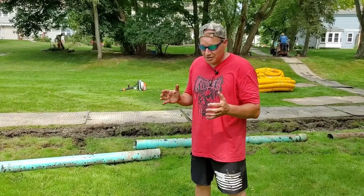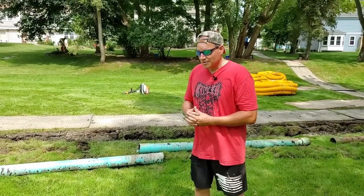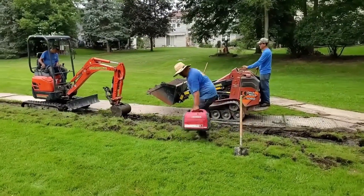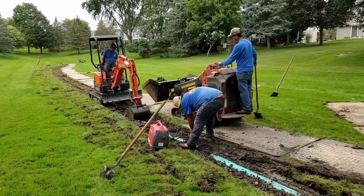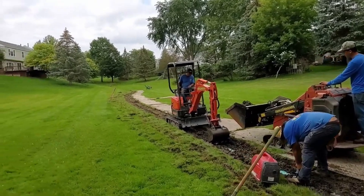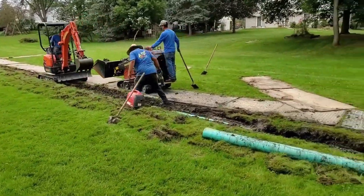Everything we preach on this channel: use a good soil separator — a really good four-ounce to eight-ounce non-woven geotextile filter fabric. We like ours punched; we actually buy pre-punched fabric and then punch it ourselves a second time in-house. We want to up the flow rating on what's already a proven product. When you have a DOT certified and approved fabric, it's not going to deteriorate. The problem with thin fabrics that some guys tell you to use is they just biodegrade and break down — they're junk in no time. We like a four-ounce in high-flow applications and an eight-ounce in low-flow applications. A minimum of a four-ounce non-woven geotextile filter fabric that's double punched is required to separate the soil from the drainage stone.